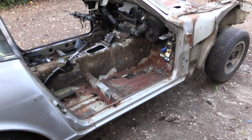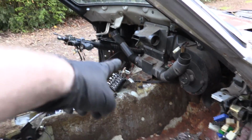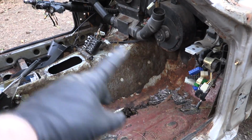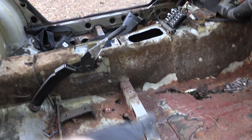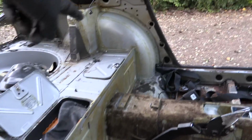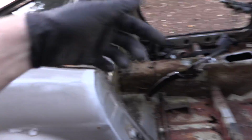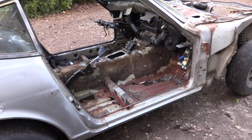Okay, I've decided cut first, brace later, because a lot of the places where I want to put braces, right now I'm thinking in the front down there, essentially through the transmission tunnel, which won't be there anymore. I want to put a brace right where this cross member is bracing the car already. I want to put a brace there, going over here, and up there in that back corner where they've got that black spot, going over to here. Four braces going across, or three, and we'll triangulate one.